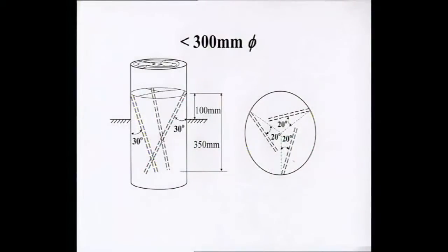In this case, three treatment holes will be drilled commencing approximately 100 millimetres above the ground line. As these will be 120 degrees apart, it will not matter at what location around the pole circumference the first hole is drilled. This is usually selected to best suit the convenience of the operator. This diagram shows the drilling pattern to be used. It is important that the holes are drilled away from the centre, or in an abaxial manner, to ensure the best spread of fungicide in the critical zone just below the ground line.